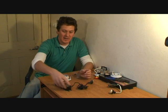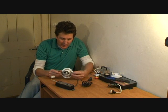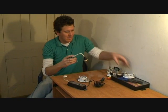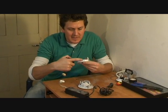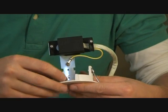So now we've got the unit out — the transformer, the plug, the old low-voltage connector, and the actual downlight fitting. Because these are so old, I can't see any slot for a 240-volt adapter. A 240-volt adapter normally has a little lug where you can locate it in a modern downlight fitting, with a small screw to hold it in place.